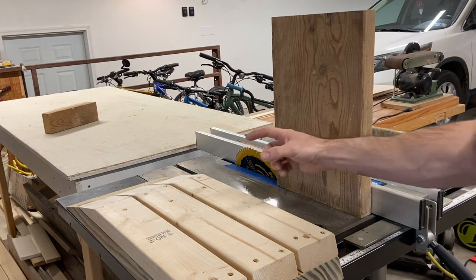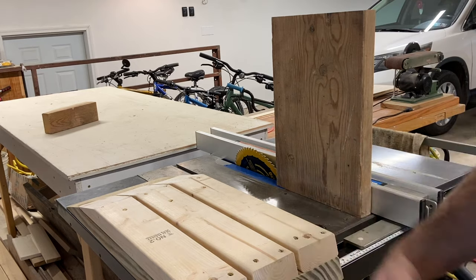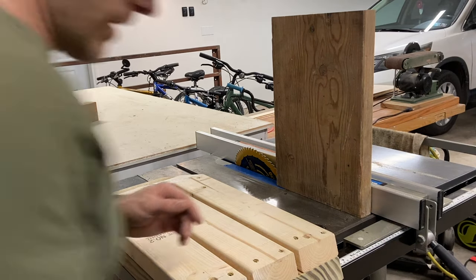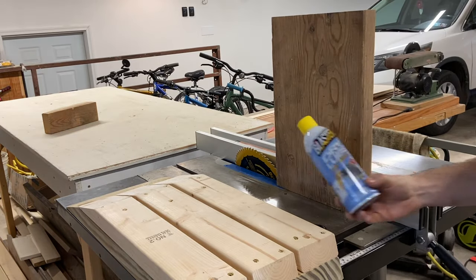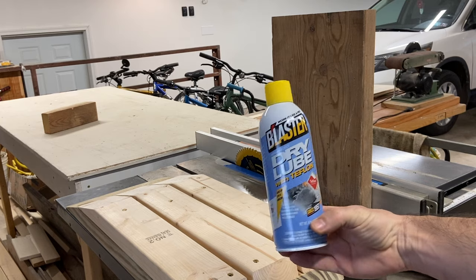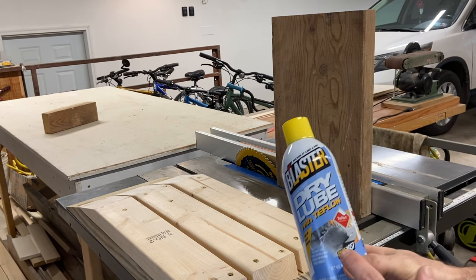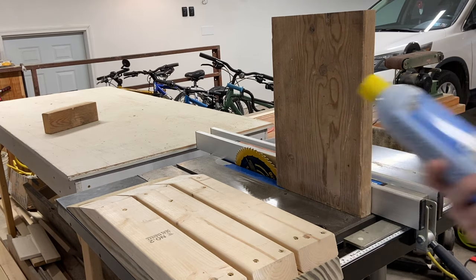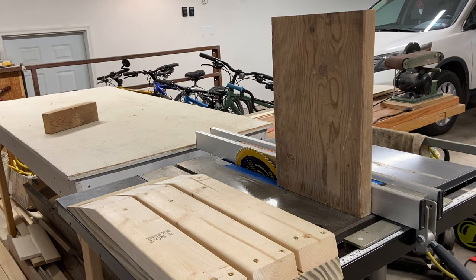But like I said, it's only kind of cut so far, then the rest you're gonna have to use a sawzall or handsaw. Another trick I have for my table saw, while I'm at it, is you can use some of this dry lube, Teflon. It's for your blade. You just spray that on your blade before you cut, and it definitely seems to help. I'll put some of that down in the description if you want to buy that, or you could just go to Lowe's and buy it, whatever.